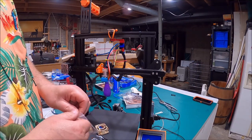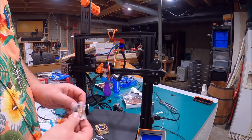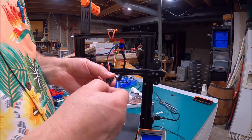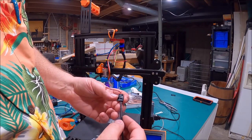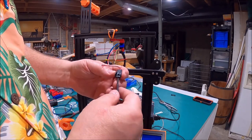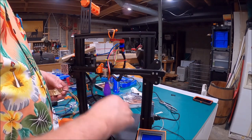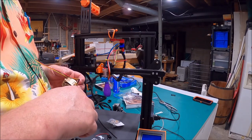This little kit has a three-wire to two-wire conversion that plugs right in — there's only one way it can plug in, and that will tell you right away what's what. You can see the far right wire — so we're going to use black and red; we're not going to use the yellow. Easy enough. Black being negative, red being positive. Now I'm going to cut this end off because we're not going to use any of that, and cut the yellow wire because I don't need it either.